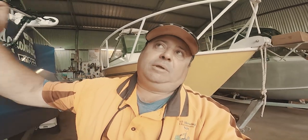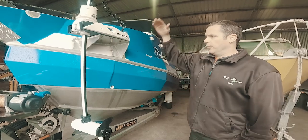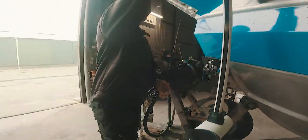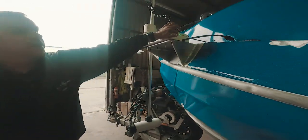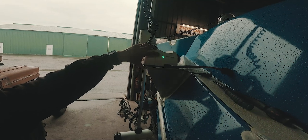Now we're going to show you what you do when the Minn Kota has a brain fart. Jamie's setting it up so you can deploy in a certain way so it doesn't damage the Minn Kota when it comes back up. This is the park reset — if things are going a bit weird, this lets the computer relearn where the trim settings are and also the angle you want the motor to be in when you start. Make sure this surface is straight with that surface, because that's where it's going to want to pull up. Rotate it to where you want it. Then power off, power on, it beeps, give it a couple of seconds, and press one, two, three.